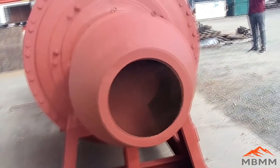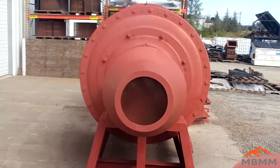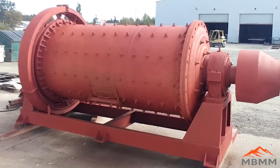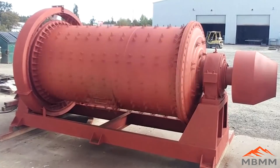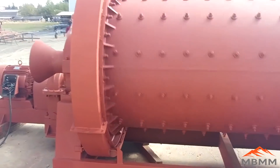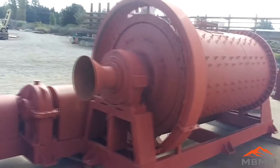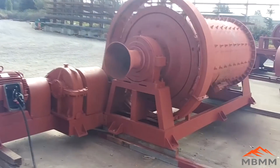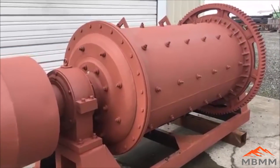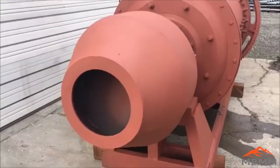This is the feed side of the mill — there's a scoop so when the material enters the drum it is scooped into the ball mill at an even rate. You can see the access door which allows for input of a new charge of balls and can also be used to clean out the mill for replacement of the liners. Here is the discharge side of the ball mill, and the material and slurry can be captured and directed down onto a concentrator. This machine will process 1 ton an hour at 65 mesh, and you can actually process finer than that, down to about 200 mesh, but the throughput goes down.